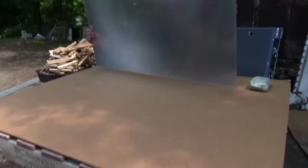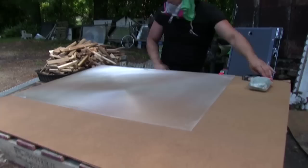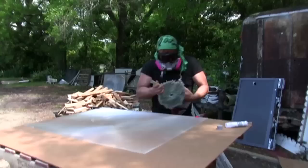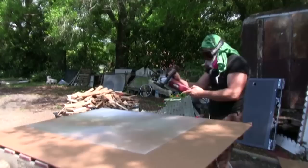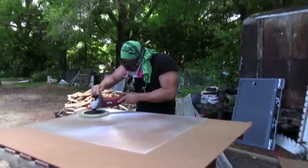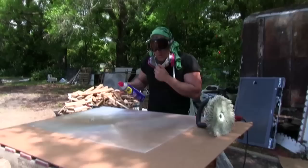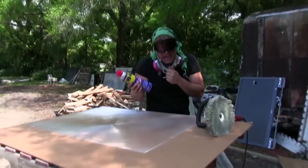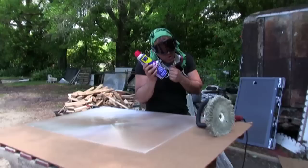I've got the Fresnel side down. I'm going to be taking clamps, clamping one corner to the cardboard and the other corner to a pallet — this is my table saw right here. I'm going to be using a coarser compound for this. Once you've worked the compound in, the little secret is to put a little WD-40 on there — not much. This will give it more friction, believe it or not, even though it's a lubricant. It will cause your pad to stick and create heat. Be careful because it's going to want to kick back on you, so you want to use a lot of strength to hold the buffer.